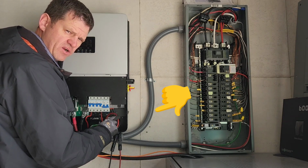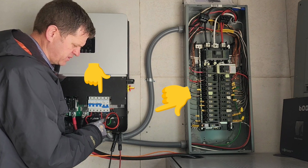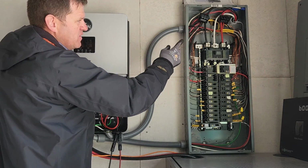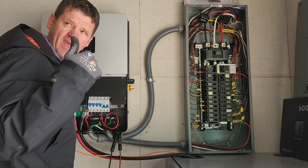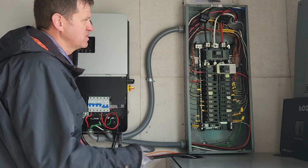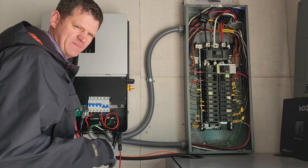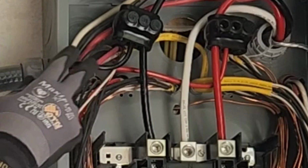Now this is number 6 wire. So right now I have a breaker right here that will protect against any overcurrent. The electrician initially gave me the idea of using Polaris connectors to tap into the grid. And he saw the Polaris connectors and said, you probably should update these to a thicker gauge. I have a 100 amp breaker near my electrical panel, and he said, keep everything simple for the inspector. Just go ahead and put a 2 gauge wire on there, and then the inspector will look upstream and see that that number 2 wire is protected. That makes sense to me because we really want to make everything as simple for the inspector as possible. So I'm going to go ahead and update these to 2 gauge wire.